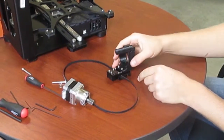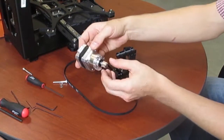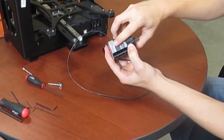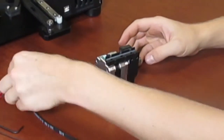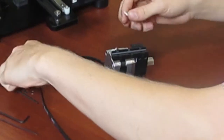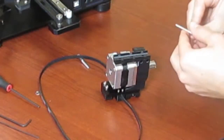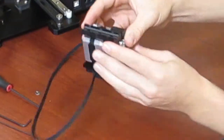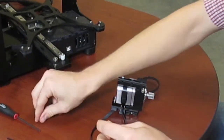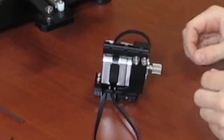After you've mounted your carriage and printed plastic part to the plate it's time to mount the extruder motor. To mount the extruder motor, simply take the motor with the planetary gear drive and slide it through this hole. Make sure the pins are facing up. To mount the motor you simply need two M4 by 35 bolts with washers. Take the bolt, put it through the washer, and slide it through the holes. I've already put in the nuts on the back. Slide one in, do the same with the other, and tighten.